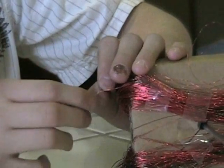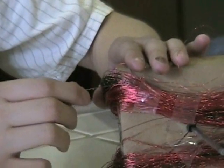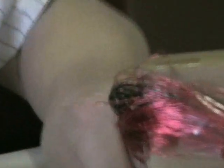Because we had a hard time getting it to work, here are some tips: make sure you take a knife and scratch out the paint because the wire is not long enough on one spool, so you have to twist multiple spools together. Make sure you skin all the paint off and twist it all together. There are like four spools of wire. When you connect two of them together, you have to strip off the enamel. It took us about two hours to figure out that problem.